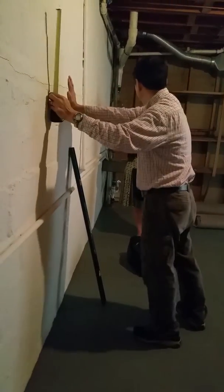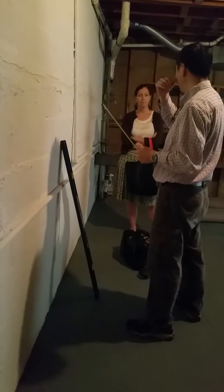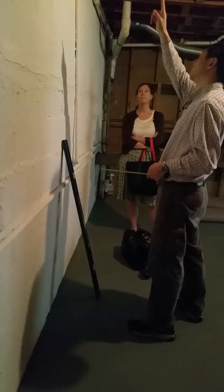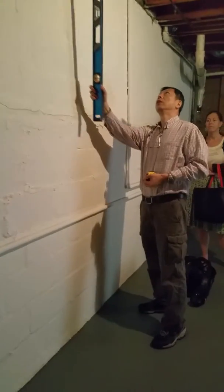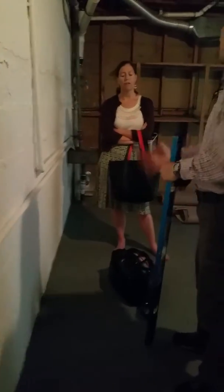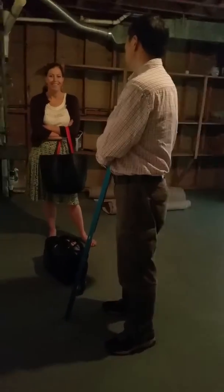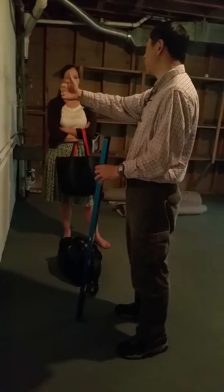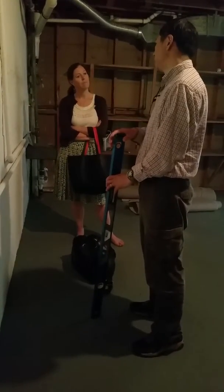The wall already bulges, so you let it live as-is but prevent any further bulging. This was structural — it had to be anchored to the floor slab. In this case, because the floor goes this direction, we can put another two-by-four or two-by-six wall in here. Once you fix the drainage, it doesn't have to be just a finishing wall — it serves a structural function as well.